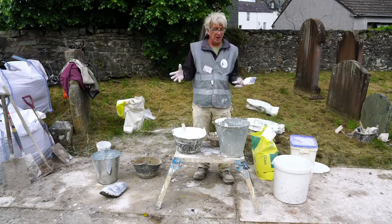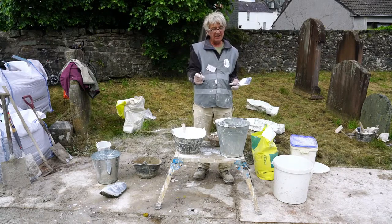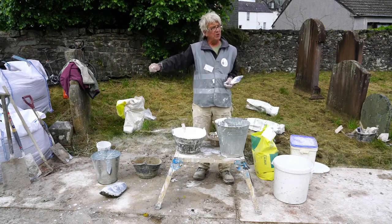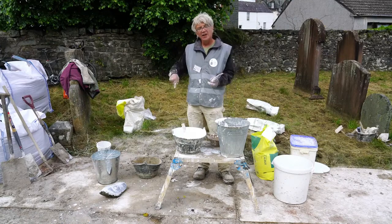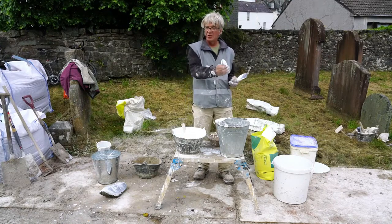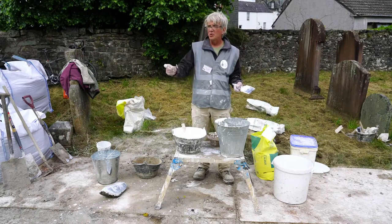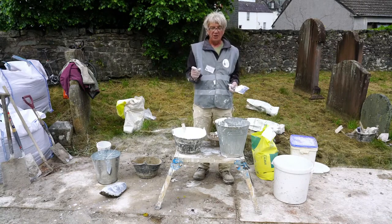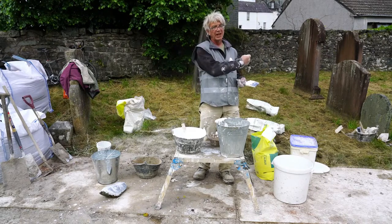So a building that I've worked on recently, a church wall that had lost its pointing, still had its earth lime mortars but set back, that wall was wet. We pointed with a hot mix, within a week it was a dry wall. Because actually having the pointing there on the face where the air can wick away the water molecules by capillary movement is what you need. You think, oh well, why wouldn't it dry when the mortars are back there? But because the air movement can't reach them in the same way. You need that surface finish to be actively sucking water out of your fabric.